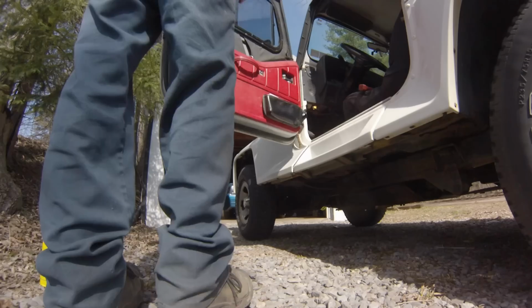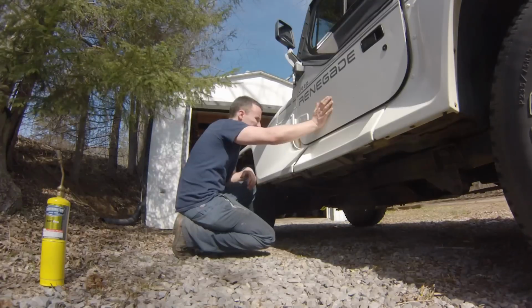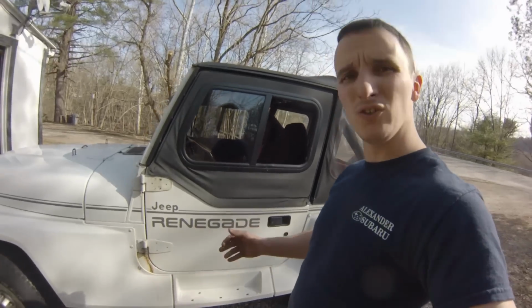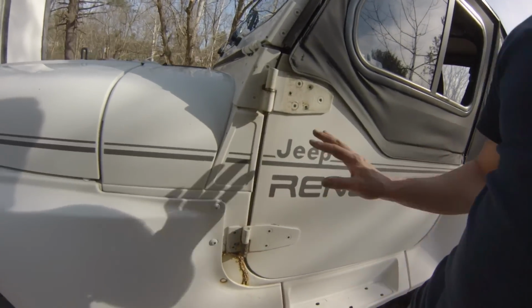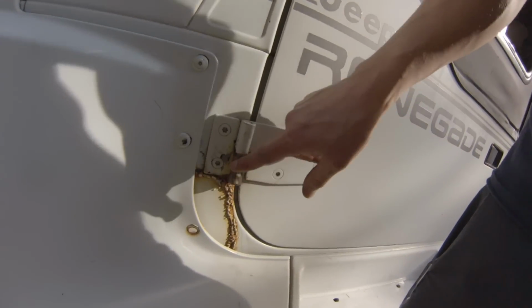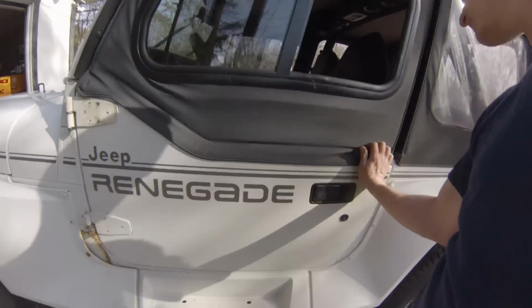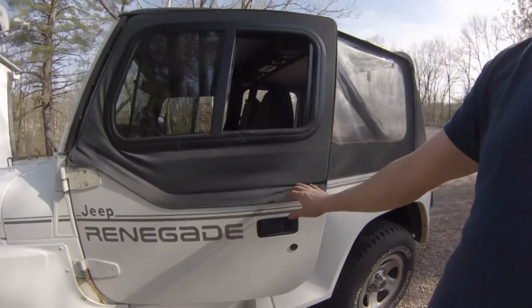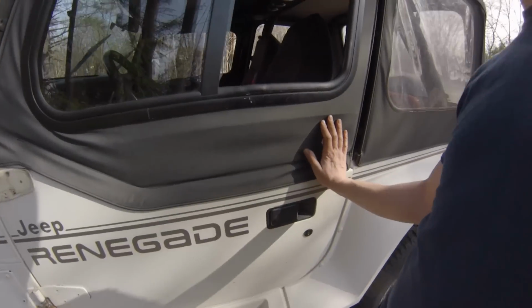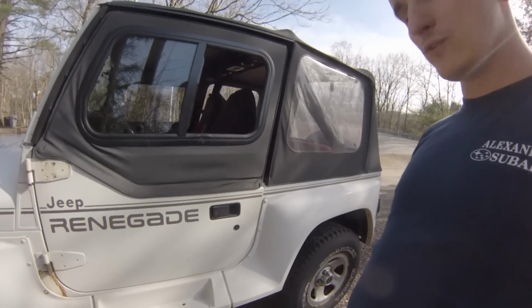Yeah, so I'm not sure how well this is going to work. Even worse. Some busted knuckles and some chipped paint later, but got it probably about as good as it's gonna get. Took it down to 2 shims instead of 3. Hammered on this, adjusted that, had to move the hinges all over the place, but that's probably about as light as I can close it. Won't work that way, but that's not too bad. A little bit of a slam, so you don't have to beat the crap out of it like before. So that'll just do for now.